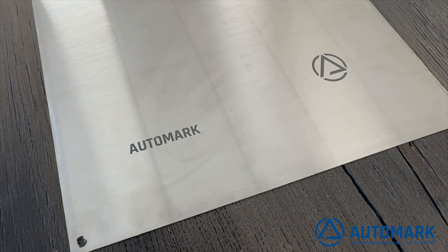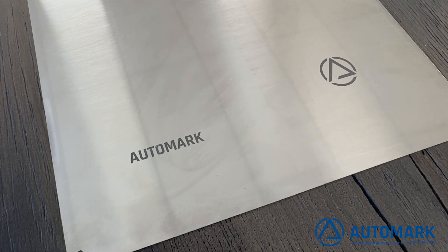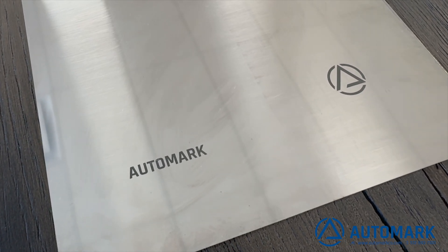The next plates that use chemicals and exposure units are thin steel plates. These plates vary in thickness from 0.25 to 0.5 millimeters. They generally allow very great detail but also great control over the depth, since they use acid baths to erode the image instead of water or alcohol in a development process. I will link to how these are made on the screen here.